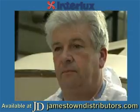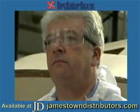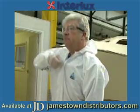Now you're ready to apply Interlux Epoxy Prime Coat 404. It is very simple to do, and it sands to an exceptionally smooth matte finish, so it's easy to check hull fairness. Start by putting on your eye protection, gloves, the appropriate mask and coveralls.